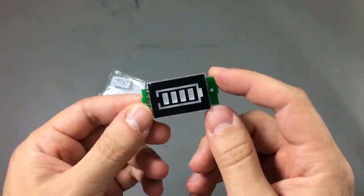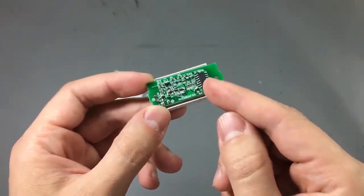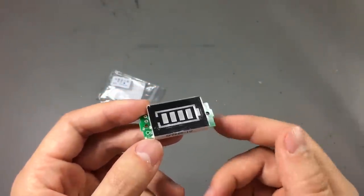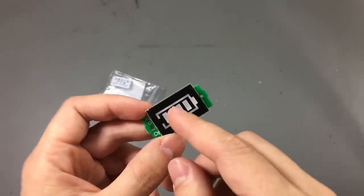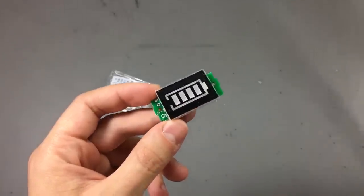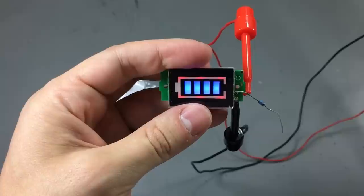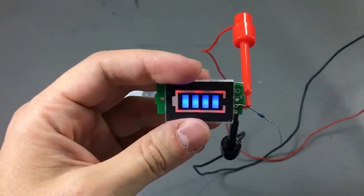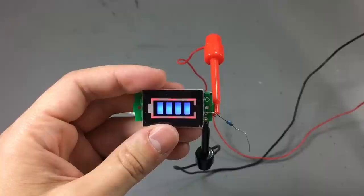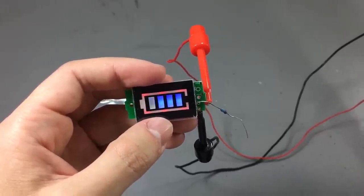Next I got one of these battery monitor indicators. They've been around a long time and are built simply — a cheap microcontroller with a built-in ADC that measures the voltage. It's just a voltage indicator, and you select the number of cells when ordering because the device is adjusted for that. Let's connect this to my bench power supply and check the levels. I'm pretty sure I ordered mine configured for a single 4.2V cell. I can see 6 red LEDs and 4 blue LEDs at 4.2V. Let's adjust lower — the top segment is flickering at 3.9V.